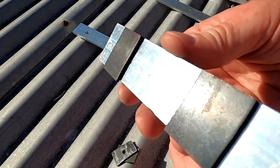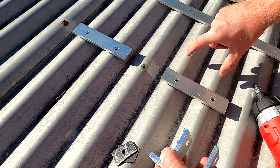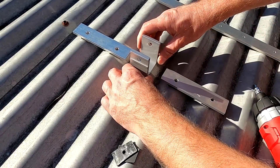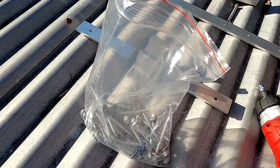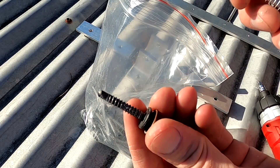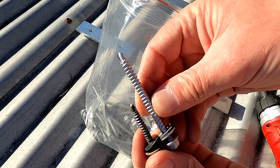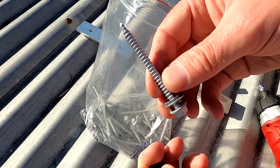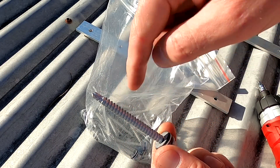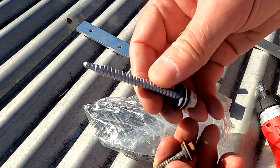I've got the sticky rubber already underneath. Look at these holes — they fit perfectly on the humps. Now, these are the existing screws in the roof, and these are the ones that come with the bracket — they look a bit different. But once you put these bracket screws in, you can never go back to the originals because it widens the hole inside the profile in the roof structure, and you can only use the larger ones from then on.